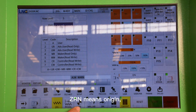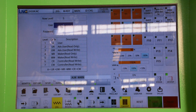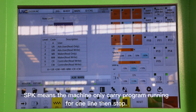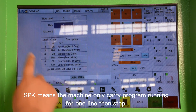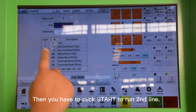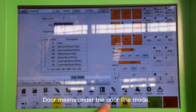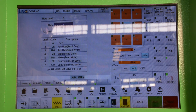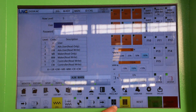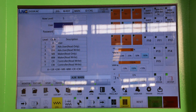MPG we already discussed. ZR means returning to origin. MPG Drive means MPG simulation. TK means the machine will run the program for one line at a time, then stop — you press Start again for the next line. Door means under door-line production mode. Usually we use Cabinet production mode, which means under cabinet-making mode — in this mode it will reset, start, and pause.